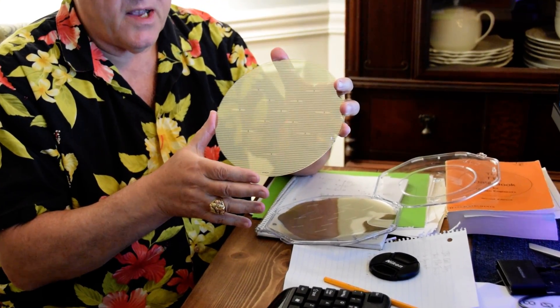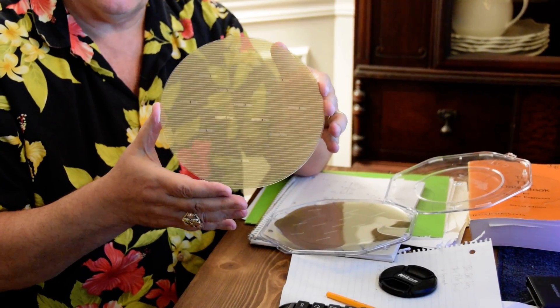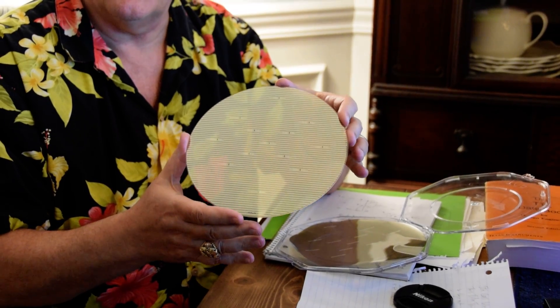With Pragmatic IC, they have glass wafers — this is a really, really thin 8-inch glass wafer — and they put a very thin layer of plastic on the top, and then image the semiconductors, the logic gates and everything, as thin film transistors.